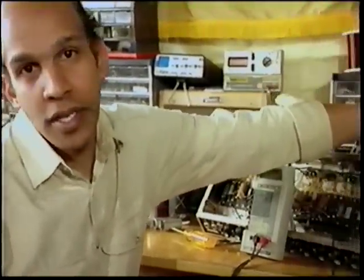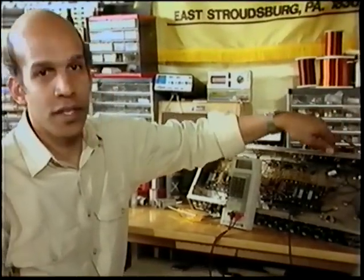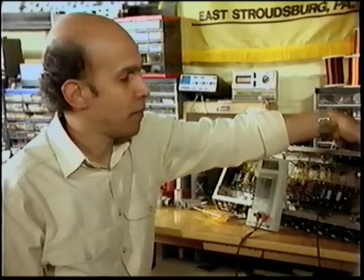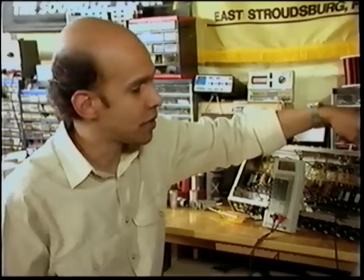So you turn the amplifier on and you're blowing your fuse. There's a thing that you can do before you take it to the repairman. It's very simple. If you turn it on, blows the fuse, and it doesn't smell funky, chances are that the power tubes are bad. Simply take your power tubes out of the amp, put a new fuse on it, turn it back on. If it blows the fuse, then that means that your power transformer is bad. If it doesn't blow the fuse, that means that your tubes are bad. Take the tubes out of another amp, place them in, turn it on. If it doesn't blow the fuse, you know you found the solution.